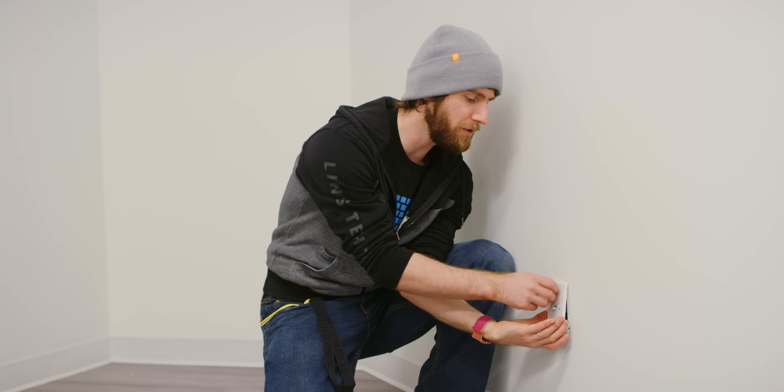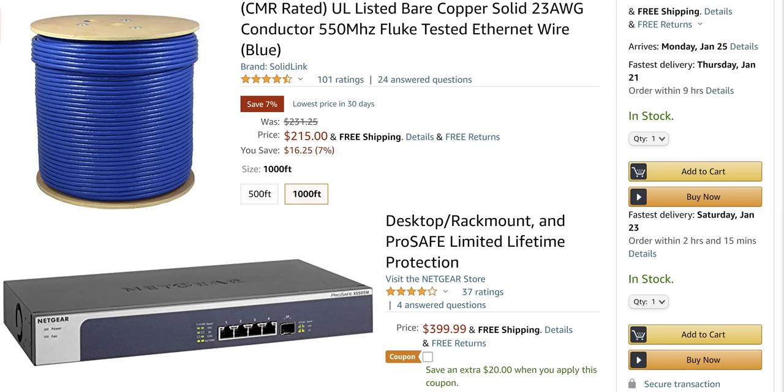Before we talk about the how of installing and using fiber, it's important to understand why fiber is even necessary in the first place. In both copper and fiber optic cabling, information is transmitted by changes in energy at a given frequency. With copper Ethernet, like RJ45 cables, the conversion of these changes in electrical energy to actual data on either end is handled by the device that you're plugging into. That's why the devices tend to be expensive and the cables tend to be cheap.